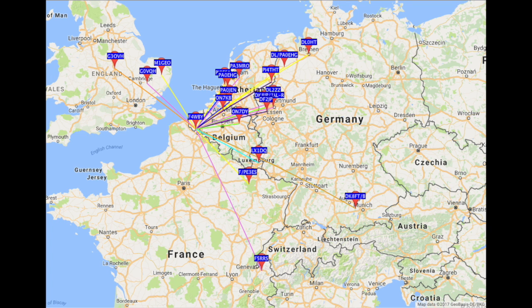That's about it — give 80 meters a try, it's worth it. It's not for DX long-distance communications, but for regional comms that's what you want to use. Use 80 meters at night or in the evening and 40 meters during the day. This test was around noon — it could have been better at night, but it shows that 80 meters is pretty reliable and definitely worth trying. That's it for today, have a good one.